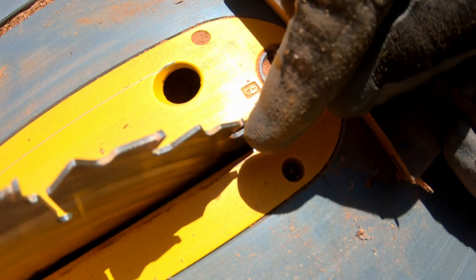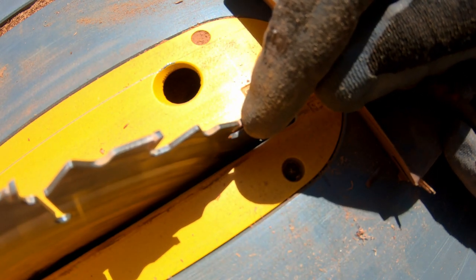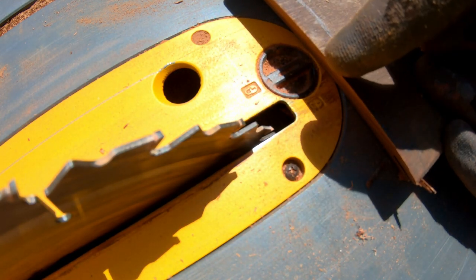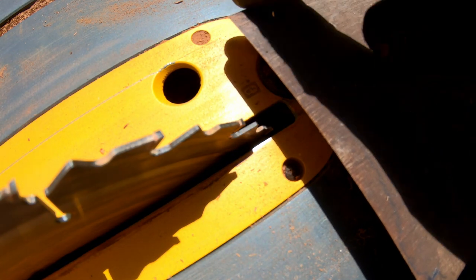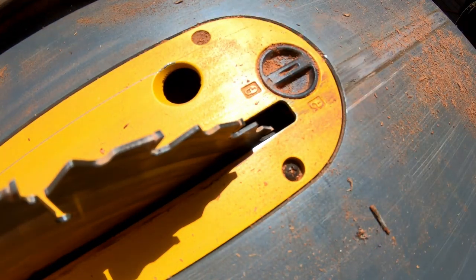This also has a sort of a more detail. We can get a, whatever this is, 3/32 inch wide cut, whereas the router bit, you know, that'd be a very small bit. And this is either mahogany or Ipe or something. So scribing this can get hairy with the router. So what I'm gonna do is I'm just gonna eat away this material and then get myself to the line. Let's do it.